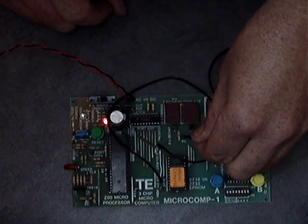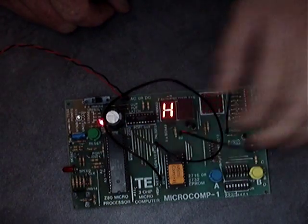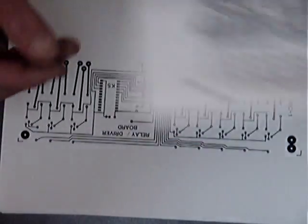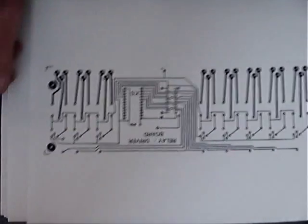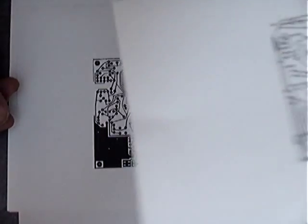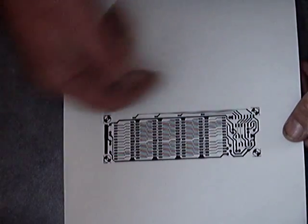It's all been a lot of fun since I was 14 years old and I thought I might share it in case anyone else wants to find out some information — I'm happy to share it. I've got different designs here that are all published in the magazine printed out: relay driver boards so you can control motors, a design for an LCD display, and believe it or not you can save your data onto cassette with that. That's the design for this one. Another non-volatile RAM board, a power supply board, and that's one I recovered out of a very old magazine where you can put different ROMs in — not a Talking Electronics design, I think it's out of Silicon Chip or something like that.